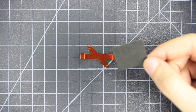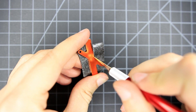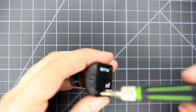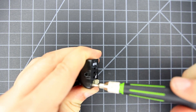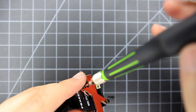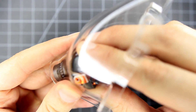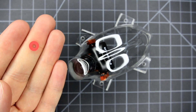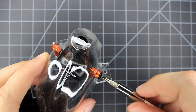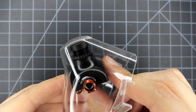For the side facing the camera, the kit comes with a small adhesive backed foam piece to prevent vibrations. Apply it on the bracket and then trim the edges with a knife. Now we have to remove the small screws from the back of the FPV camera and install longer ones so it will fit with the bracket — use the longer 2x8mm screws for the HS1177. The Foxeer Arrow will also fit, but you'll need longer 2x10mm screws which are not supplied. Test fit the camera on the pod and pop it into place. Make sure whenever you use any hardware on the pod to always use fiber or nylon washers — never put a metal screw on plastic, and don't overtighten. It supports around 30-50 degrees of camera tilt.